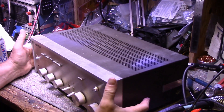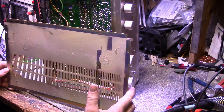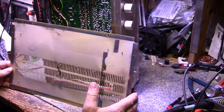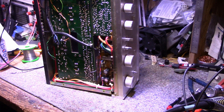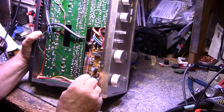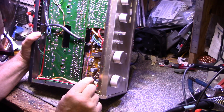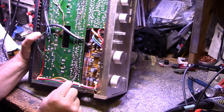Let's pull the lid off and have a look inside. Judging from the dust in this thing, I don't think it's ever been opened — I don't ever remember opening this myself. The dust on the bottom here is pretty thick. Looking around, there's a lot of circuit glue here on some of these circuits — might be the cause of the terrible sound, you could have some shorts. There are some areas here that are a little roasted by the heat.